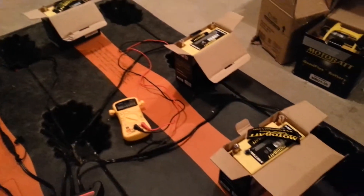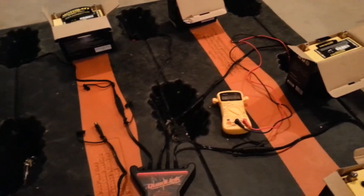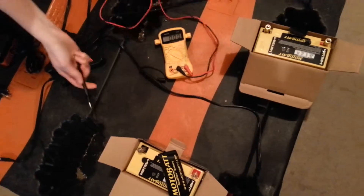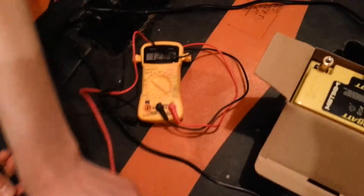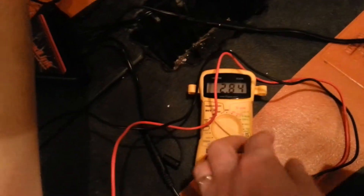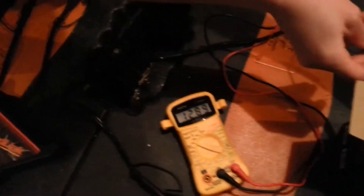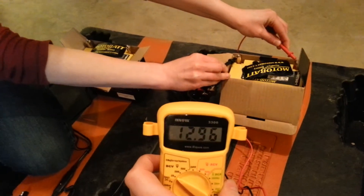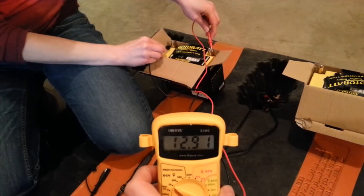I just pulled them off the shelf — none of them are connected, and I've got the four leads pulled out. The voltages on each battery are at proper voltage, all probably mid-to-high 12s since they've already been on a charger. Battery number one is 12.85, battery number two is 12.89, battery number three is 12.96, and battery number four is 12.91.